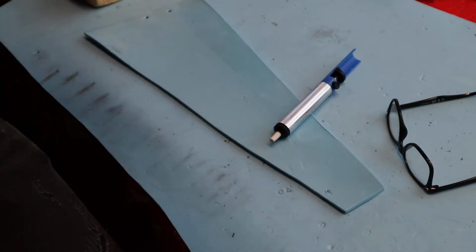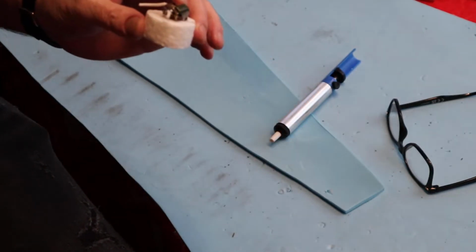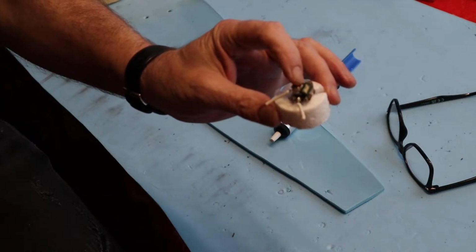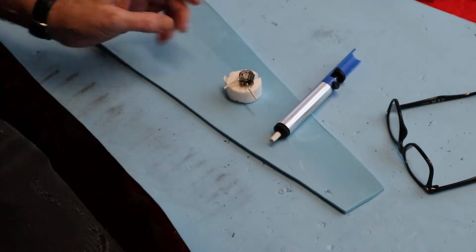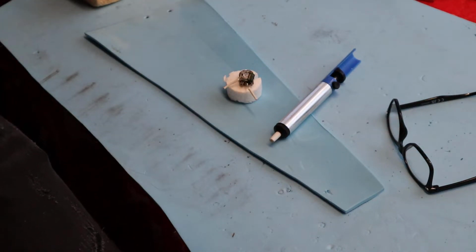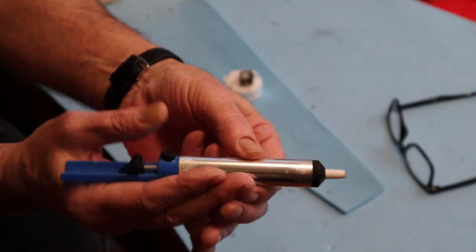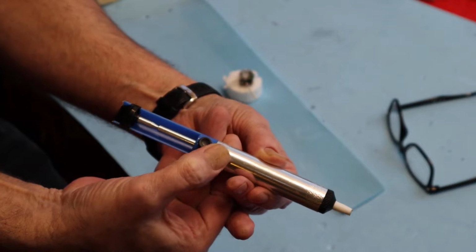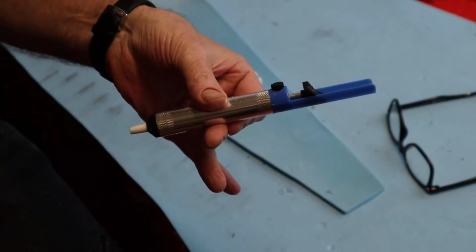So I've used one of those little foam thingies that they use to protect the 3-position switch tip on a Gibson type guitar, and that just holds that neatly in place so that I can work on it. Obviously I've got a soldering iron because I want to remove all the duff stuff that's on there and any remaining wires, and I'm using one of these little plungers where you stick that on the molten solder, you press, and that sucks off any of the old solder. You don't have to use one of these, but they ain't half useful.